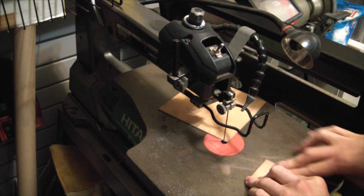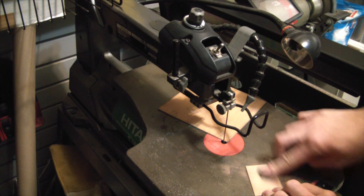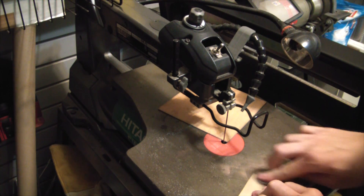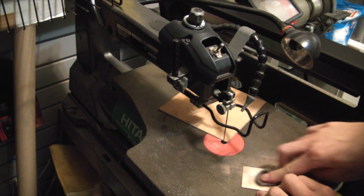Clean both sides because we don't need the copper on the back. Instead of using the CNC we're going to do the ferric chloride etch, because a lot more people have that handy — and quite frankly, I still suck at the CNC.